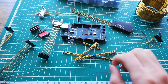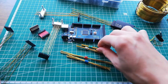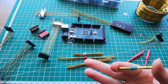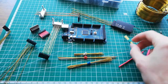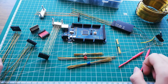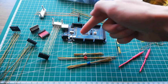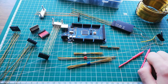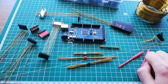And why are these wires here? These are basically in case I need to build a frame or any sort of shape to hold them together and give the entire thing some structure. I can still always use them to solder two parts together or make angles or make a small frame or outlay for everything. And connect grounds and plus rails as I see fit. Because there's a lot of these things that need 5 volts. So connecting everything to one pin wire would be fairly easy. But yeah, we are going to head over to CAD and look at the design we've got.